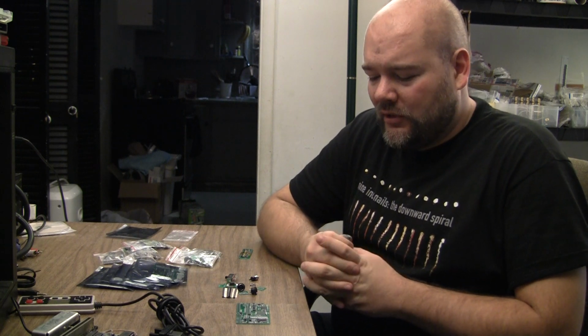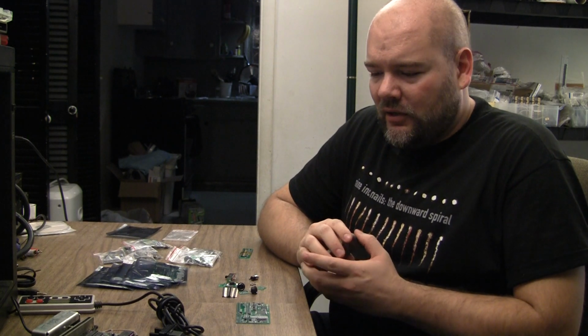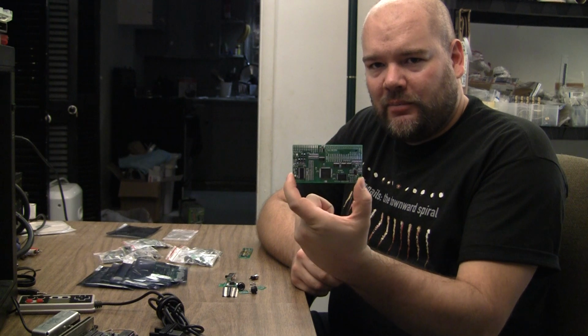Okay, I'm finally getting around to starting working on Tim Worthington's NES RGB boards. His online ID is viletim, and it's the Shmups forum where his main thread follows this project. Basically, this board fits in between the motherboard and the PPU of the NES and will output analog RGB.